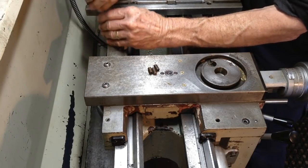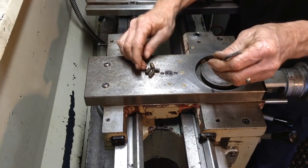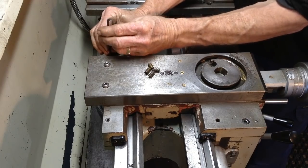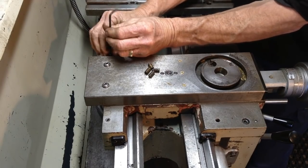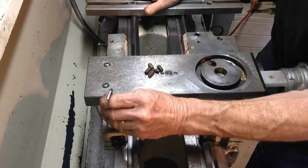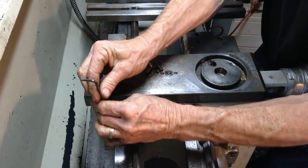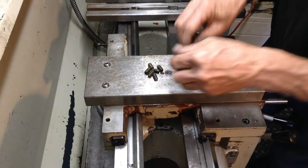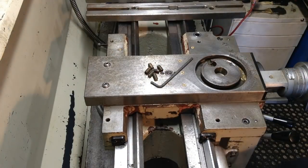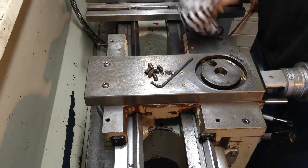At the time, the Bridgeport wasn't even powered up. I know when I made the boring bar I had to manually slot the square holes with the quill. All the fixture plates were machined on the little old Chinese bench top mill. The grub screws are purely just to keep the crap out of the holes.